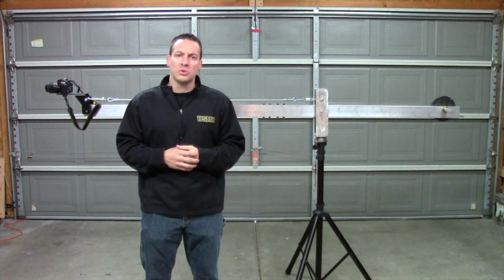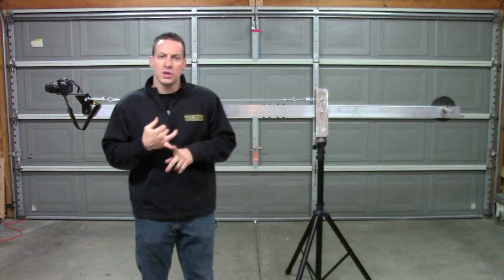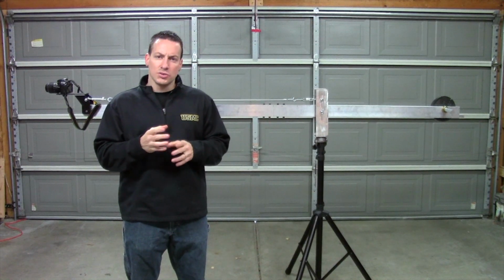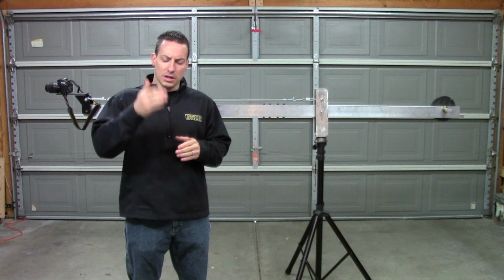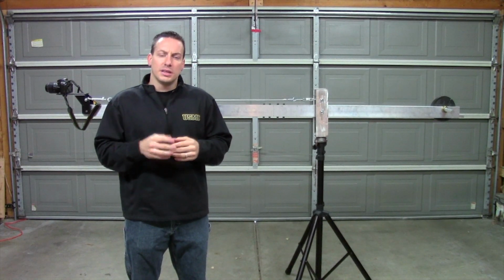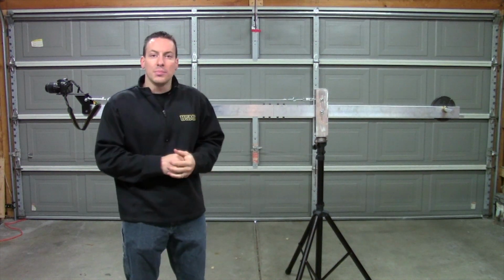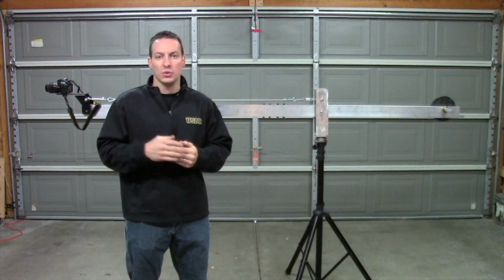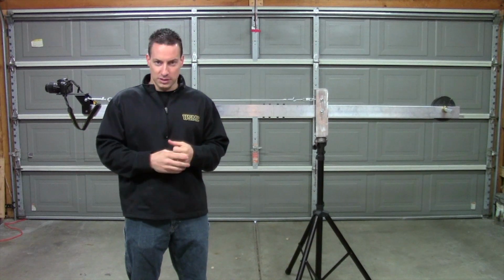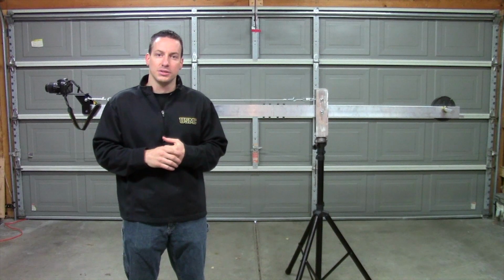Alright, let's start out now with the parts that I used in making this project. For the metal, I used 1x3 by quarter inch aluminum. I wanted the structural strength of the 3 inches vertically and the 1 inch widthwise. This gave me a lot of strength and was overkill for the size you're seeing behind me, but I'm planning on extending onto it another 4 feet in order to give you those nice overhead shots without anything in my way causing a safety issue.